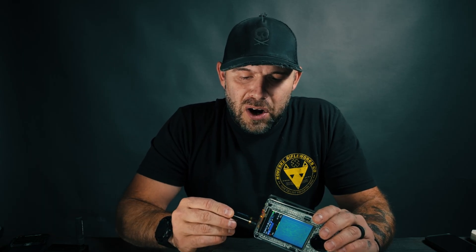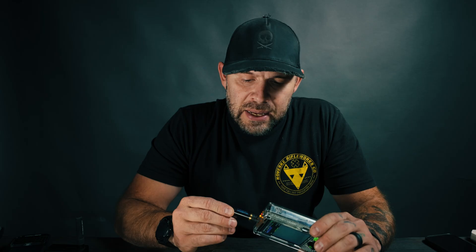I am also using all the same antennas — these are the Diamond SRH805S. They are good for the 144, 430, and 1200 megahertz ranges, so it's a wide-band antenna. I got these on AliExpress in like a four-pack. I wanted to keep this as close as possible to apples to apples and not apples to oranges.